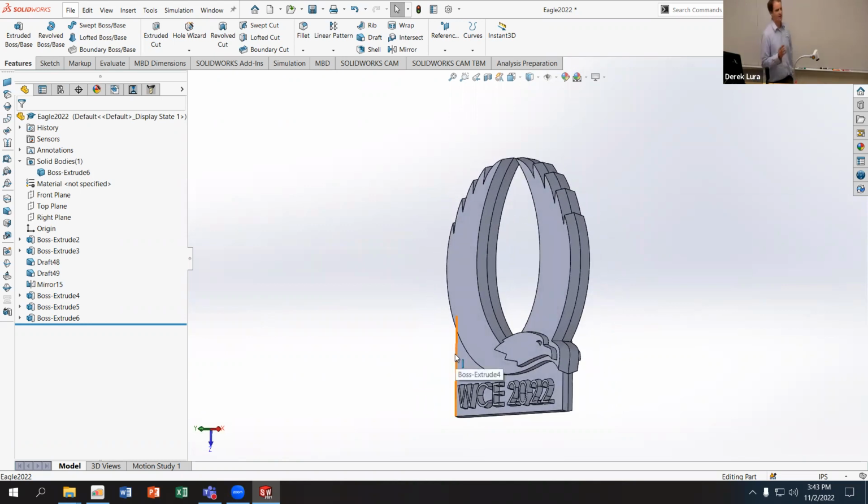And I want to try and figure out a way of designing this or orienting it so that the gases, whatever those gases are, usually air, can escape from the mold as easily as possible. And so if I'm going to be gravity filling something, that means making sure that the part does not have ceilings or caves inside the part as we fill it up.